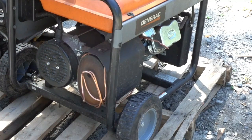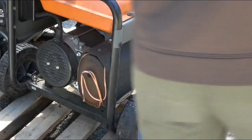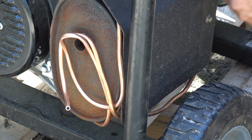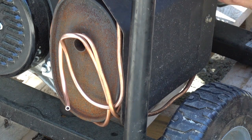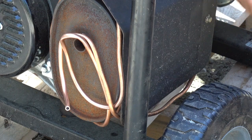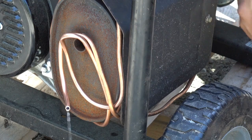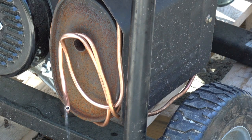So when I pop that other end, if we kept the seal, water should come out of there because it's higher. We're going to make sure you leave yourself room to work if you're doing it like this, because if you can't cut it off there's no sense in it. There you go — and look at that. The water comes out. That means there's flow going through there and it's not leaking.